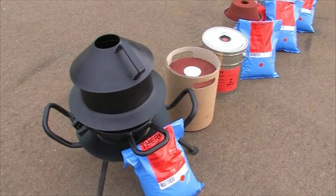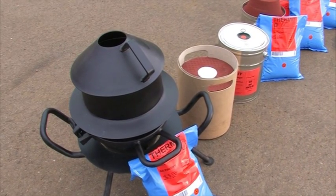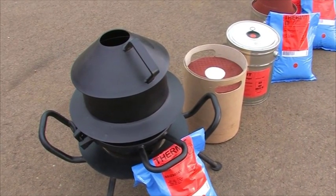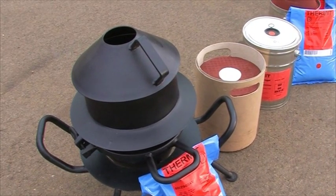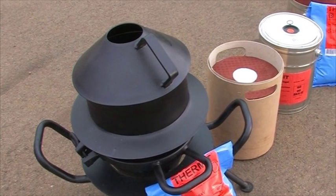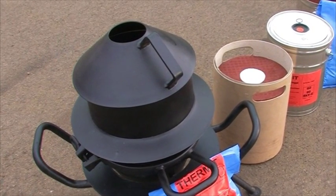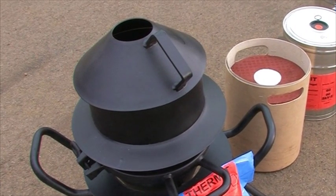Now the crucible is to be prepared. Before each welding, you must ensure that the long-life crucible doesn't contain any moisture. Porosity in the weld would result. Thus, dry the crucible uniformly by a soft torch flame inside until the outside of the crucible has reached a temperature of at least 100 degrees Celsius.